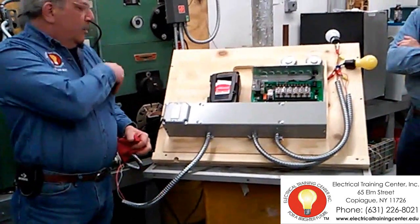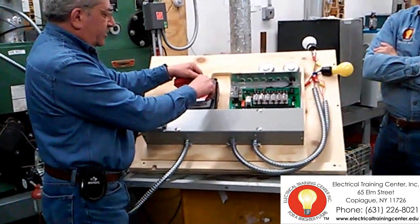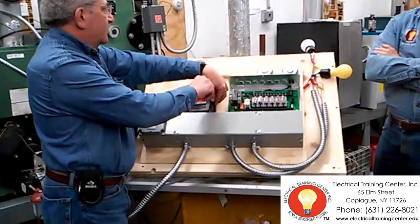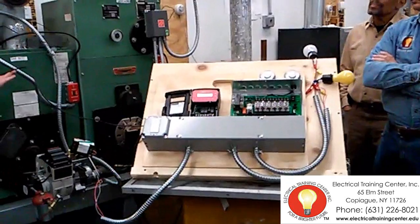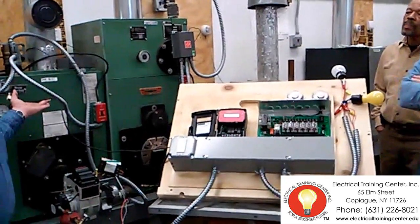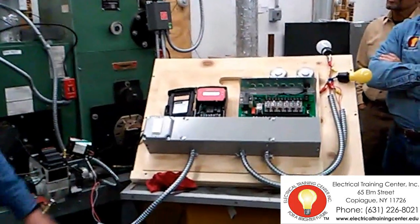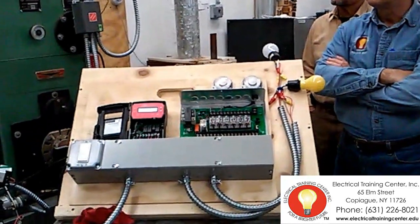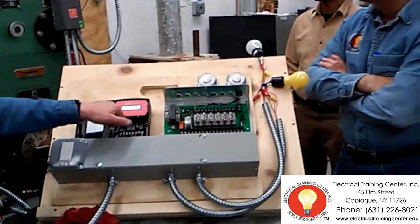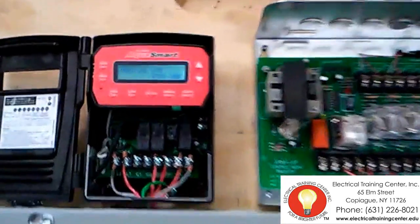You are going to see on the Beckett AquaSmart, on the LCD screen, the temperatures and actually what's going on inside of the boiler as far as water temperatures are concerned. We do have a high and low limit extension sensor, made by Beckett for us, tied into the boiler. So we'll go ahead and turn the power switch on. We're going to make sure that none of these zones are calling for heat — we just want this boiler to operate at first. You can see what the Beckett control is telling you: it's telling you what the temperature of the heating water is inside of the boiler, all done via this sensor into an aquawell.